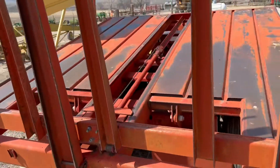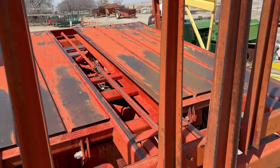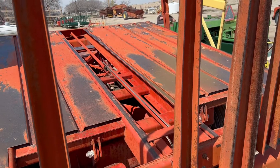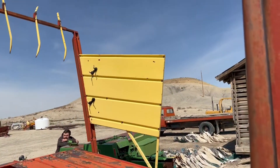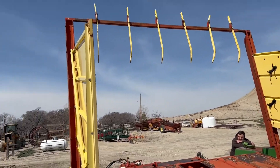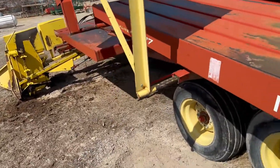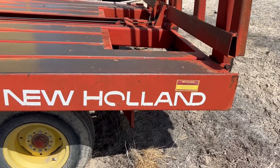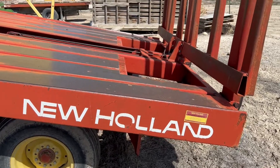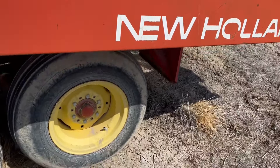The load rack and the rolling rack on it looks good. You can see it's got the hydraulic cylinder that takes it back up to the front after you dump the load off. Everything looks to be in good order — good metal sideboards all the way across. It's got all six tines across the top. This is a three-wide, seven-high bale wagon, so you'll hold about 105 bales on this little guy.